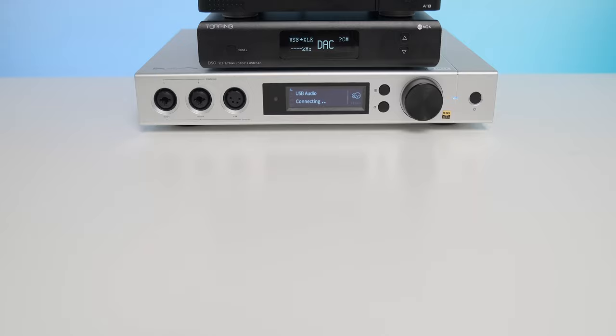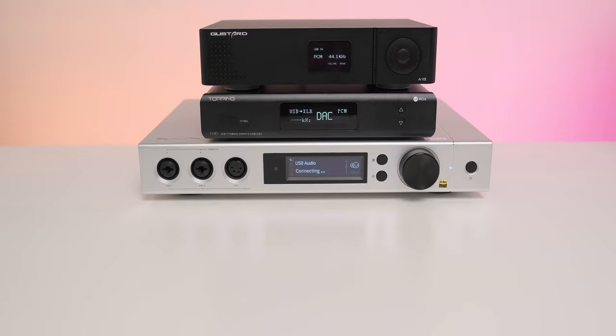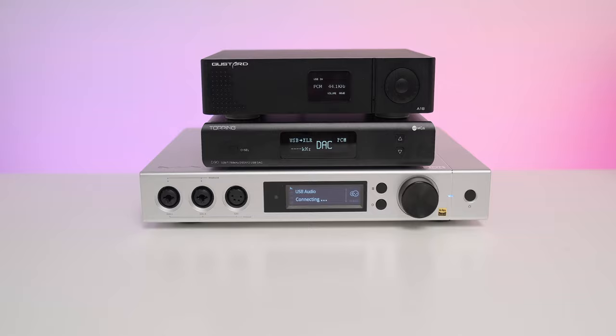I cannot go forward without saying how close this A18 is sounding to the A22 and even to my own Matrix Audio Element X. I'm again spotting that lightning-fast bass performance, that natural mid-range without going overboard into the smooth and warm camp. Treble can be considered extended but without any signs of digititis. Gustard simply knows the limitations of this chipset and fights back its flaws. The discrete output stage of the A22 was replaced by LME op-amps in the A18, which are among the most transparent and linear-sounding op-amps in the business. The marriage between those flagship AKM chipsets — strong in the mid-range but weak in the top octave — and these LME op-amps makes the A18 both a very musical and very transparent sounding unit.